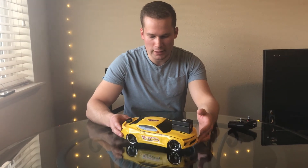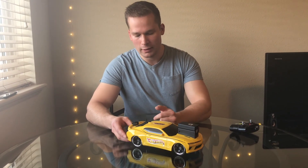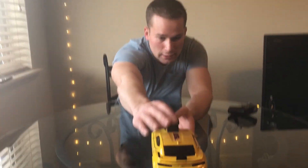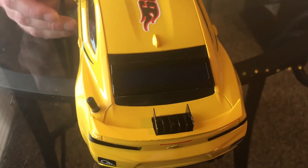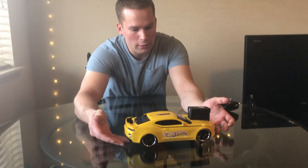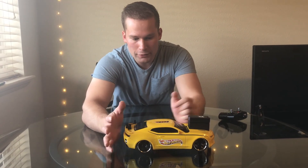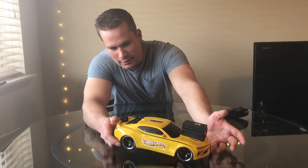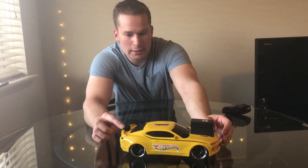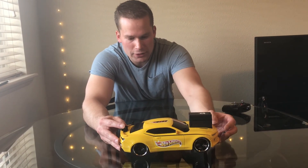The way I've accomplished traction control on this thing is I've basically piggybacked off of the original wiring going back to the rear motor and hooked it up to an H-bridge module through the Arduino. This H-bridge module, which you can actually see here — these vents sticking out of the back, very nicely cut out of the bodywork — is powered directly off of a separate power source than the regular Arduino. So there's actually three power sources on here: one for the RC car originally, another 9-volt battery to run the Arduino, and this big pack of batteries that I thought looked kind of like a big block engine, so I stuck it up on the front. That puts out about 13 volts, but this H-bridge is not very efficient, so it cuts that down to about 9 — still, that's way more than the 3 volts it originally came with.